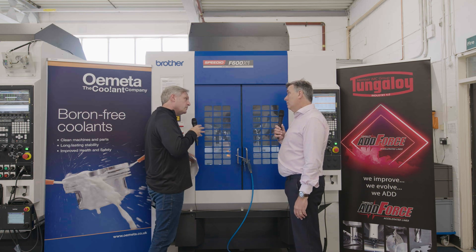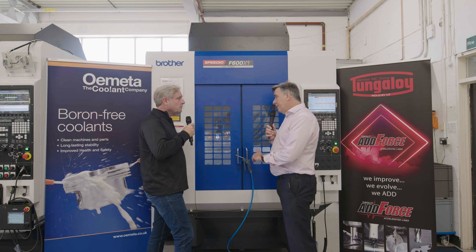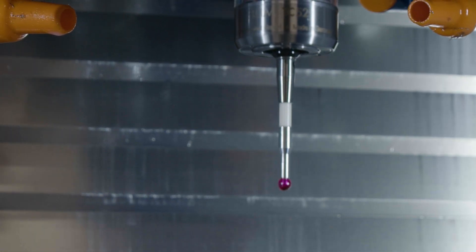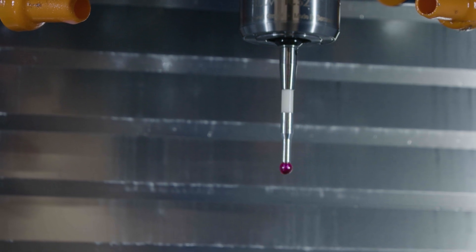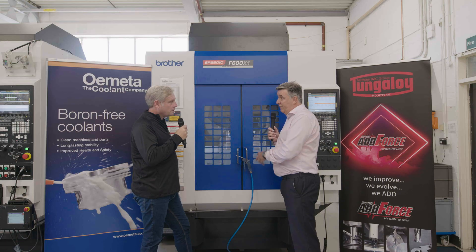When you say about the checking, you've then got your probe system — the TC52 and TC62? Yes. In this one we've got the TC52. It's an infrared probe. The probe can be used for simple conventional probing for setting up the workpiece initially when you first put it on and checking some basic features of the part. But it's part of the Digilog family, so it's got the analogue aspect where we can flip into Digilog mode and start to scan freeform five-axis parts to dimensionally check the part, and we can also check surface finish.